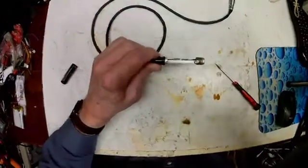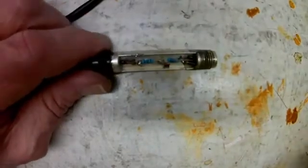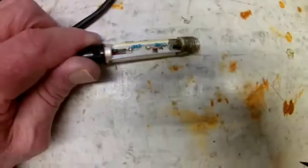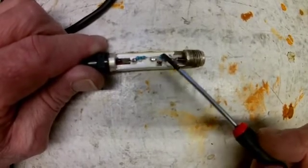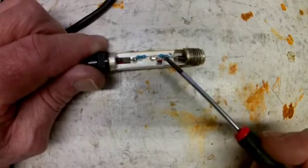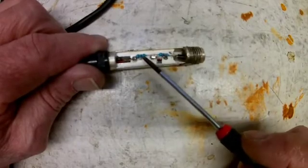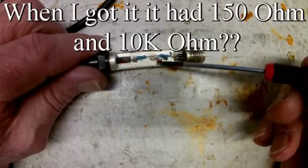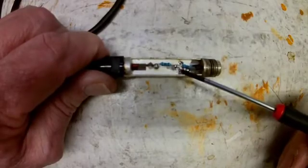Here's what we've got. Inside of it, there's a couple of resistors, and these are matched to the unit that you buy. That's the problem. After a whole lot of studying, I sort of fudged it — I put in a 330 here and a 150 here, and this little guy down here is a .001 cap. On the other side of this, same thing: 330, 150, and another .001 cap.